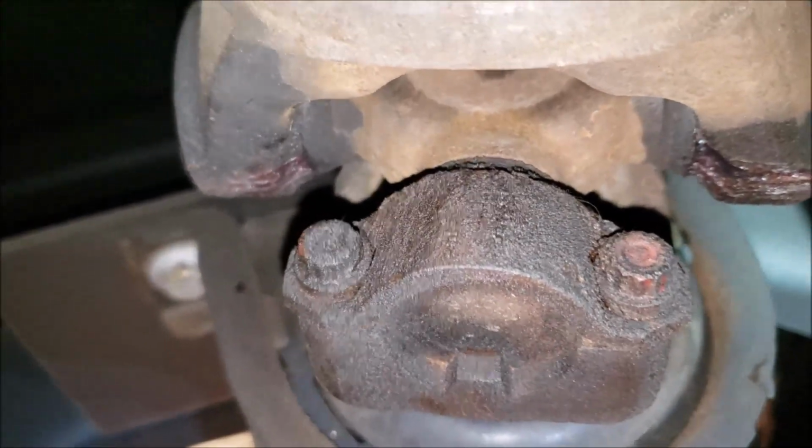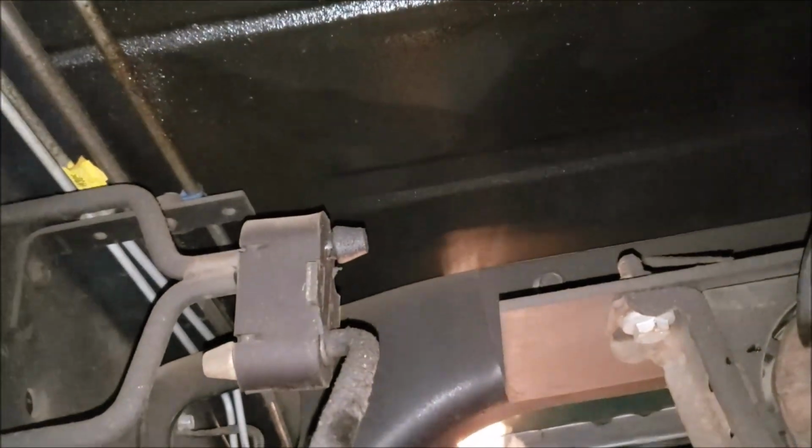It's all this residue up here where the grease is slung out of the universal joints. I'm spraying that brake cleaner on there so I can dissolve it and turn around and wipe it off. So I'm trying to go a little bit easier. I just put like 2 squirts in that joint. I don't know what the magic amount is, but I don't want to stop greasing it. But even this one back here, you can see where I wiped it off last time. I'll wipe it off some more.